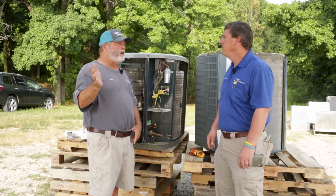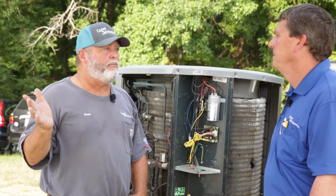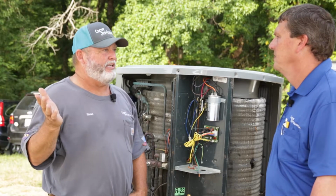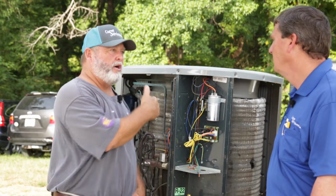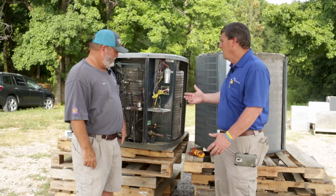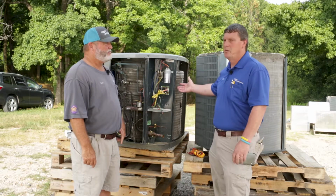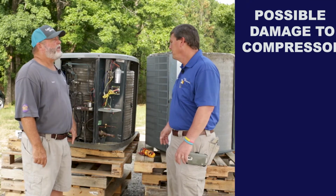What happened? Let's go over overcharge. You know, the old people always think, give me more, give me more, give me more tonnage, give me more Freon. That's not it, is it? That's not it. So if it's overcharged, what could happen? Well, same thing. You're not gonna get optimal performance out of the system, and you're gonna do a lot of damage to your compressor. What kind of damage?